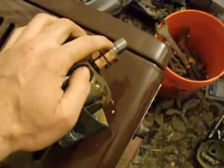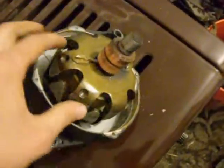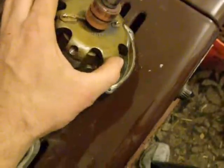It can't be a 5 amp, it can't be a 6 amp — it's got to be a 4 amp. So it's got to be a used rotor. Why it tests 4 amps versus 5 or 6 is because the armature has absorbed some magnetism and it's got some permanent magnetism to it. So it doesn't draw that many amps. It basically doesn't draw as many amps because there's already some magnetism to it, so it doesn't have to work as hard. And that's what you have to have for that regulator.